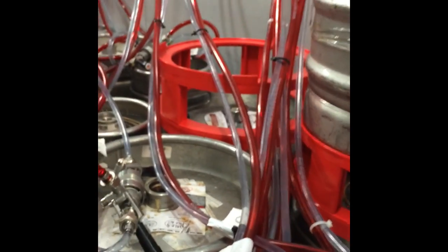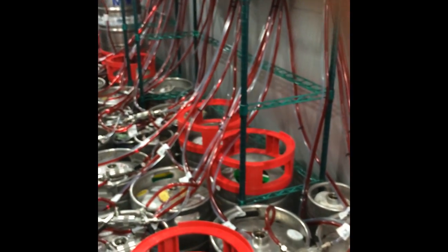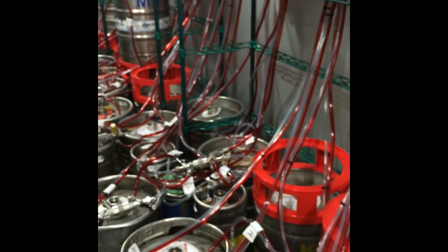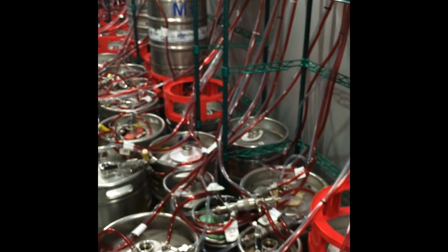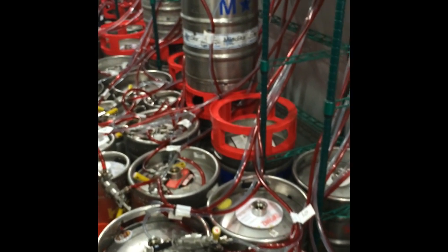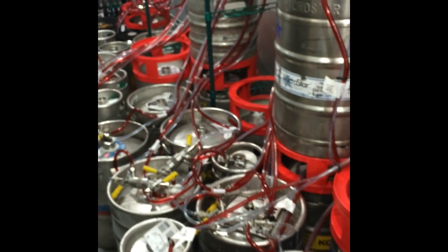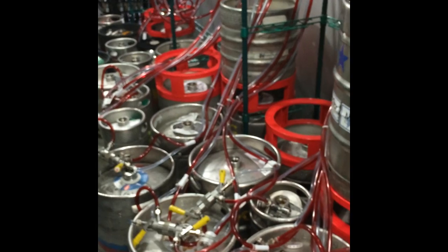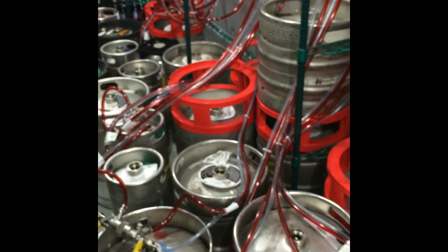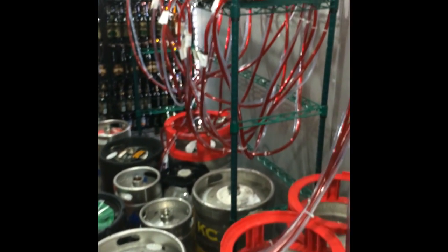This cleaning is done every single two weeks, and then once a quarter we also do the acid cleaning — caustic being the cleaning that gets rid of bacteria, and acid being the cleaning that gets rid of beer stone. Once a quarter, these couplers are disassembled and completely cleaned. Every single two weeks, they're brush cleaned and sanitized with an acid-based food grade sanitizer. We use Star San, but there are others out there.